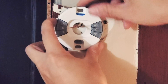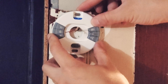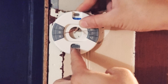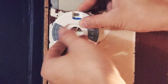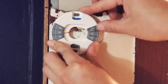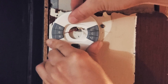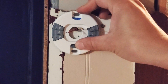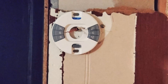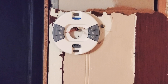Basically what you do is put the base plate here, align it straight according to the level, then screw it in with the two included screws. Then mount the wires — the red one to RH and the white one to W1. If you have other colors and cables, make sure you read the instructional manual, especially if you have a more complicated system with both heating and cooling. For me I only have heating, so those are the two wires I need to worry about.